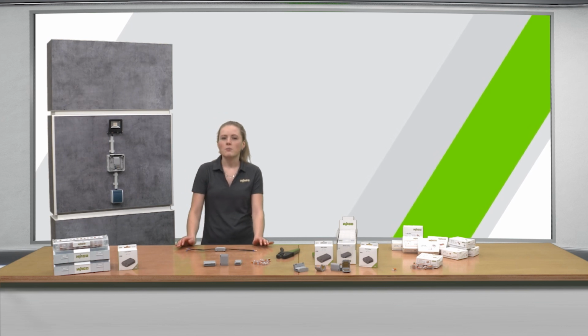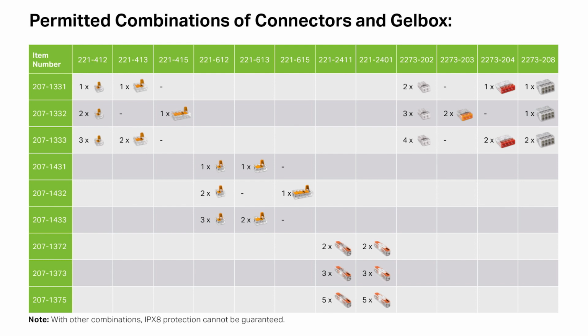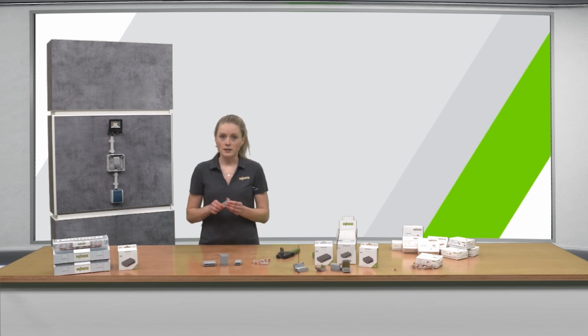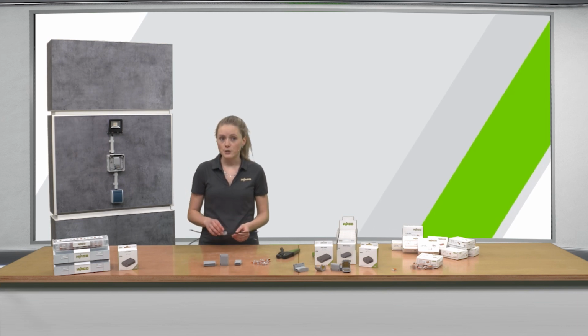When using the Gelbox, it is important to consider the assignment table to guarantee the optimal gel displacement and also the high IPX8 protection. This means that I cannot put only one inline connector in the Gelbox for 2 connectors, because the displacement of the gel is then too low and moisture will enter.